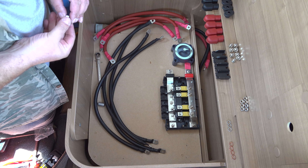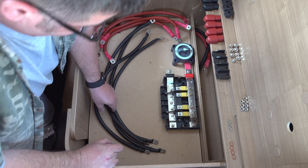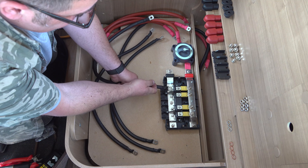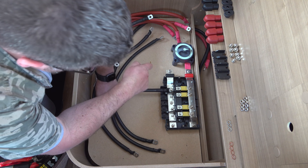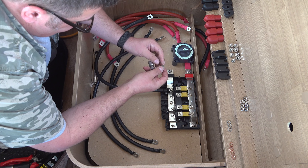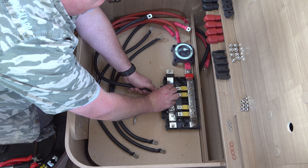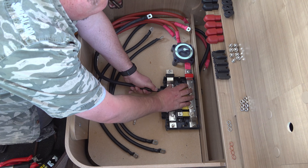Although the batteries are fused at 100 amps, I have used 70 millimeter CSA cable. This will ensure low resistance and good balance between the batteries. I used a hydraulic crimper to put the lugs on and then used some heat shrink to add mechanical protection.